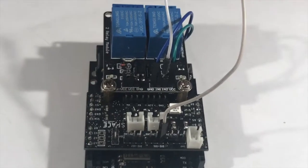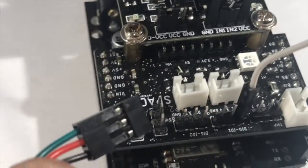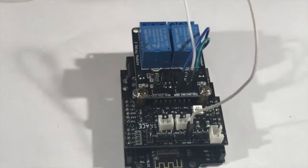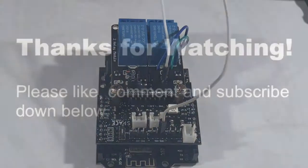So now when digital IO channel 1 triggers, it's going to trigger both of those relays in parallel, and digital IO channel 2 is now free. You can go and plug in a motion detector there. The caveat is that both relays will trigger in parallel, or you can only use one of the relay channels.